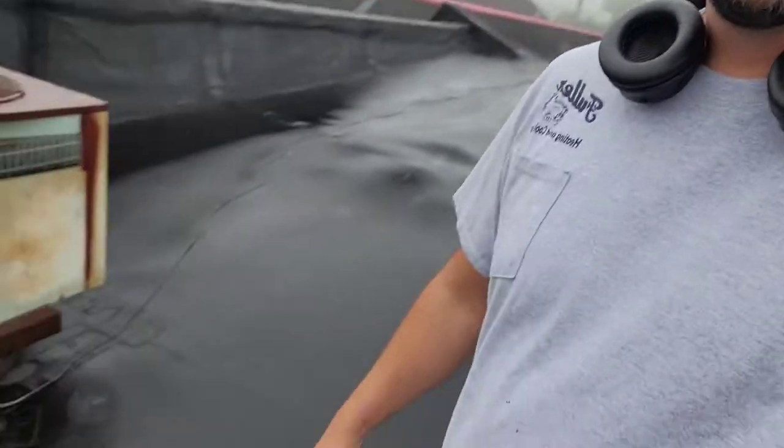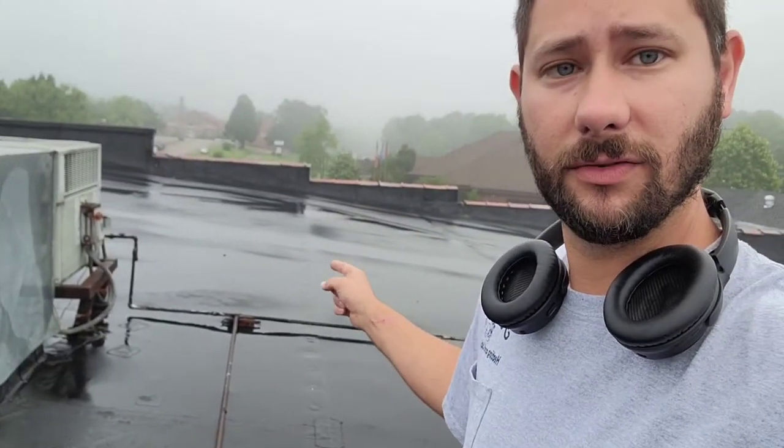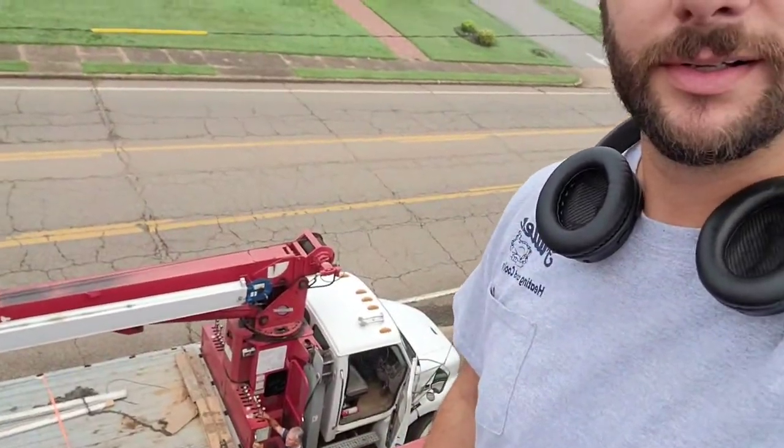It's made by Carrier. What you need to think about when you have a crane lift is how far up and how far over the unit is, so that the crane driver knows if his crane is capable of doing what you want. For this lift, the crane driver said that this direction over here, 70 foot over, was not gonna work. So I looked at the building and then the ground, and of course considered the power lines, and figured out that the front of the building was gonna be the best location.